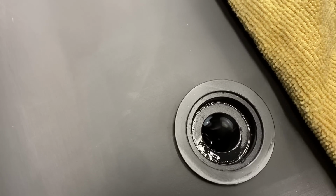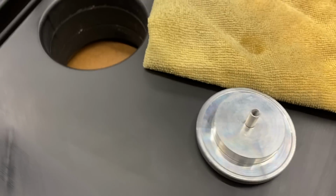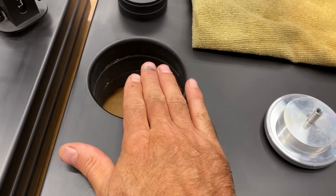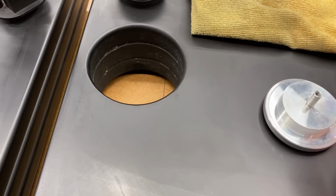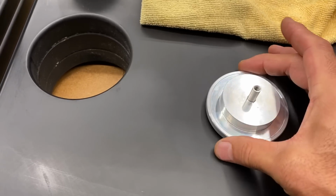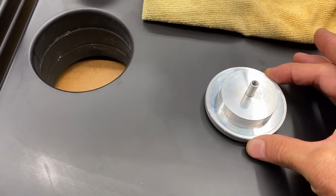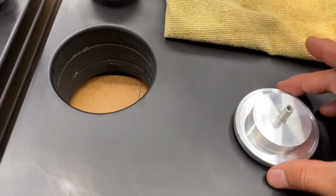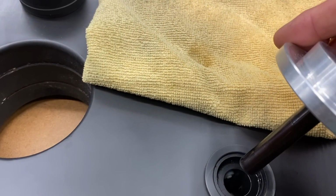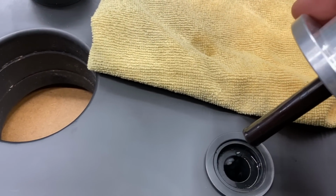So the spindle or the drive sits within this cup and is held in place by pressure from the belt, the drive belt. So if you can picture the motor here and the belt going around, the belt's elasticity is going to push this bearing in this direction, right? And it's going to push it up against the bearings, along with a third bearing down below, and that is essentially the thrust bearing pushing upward.